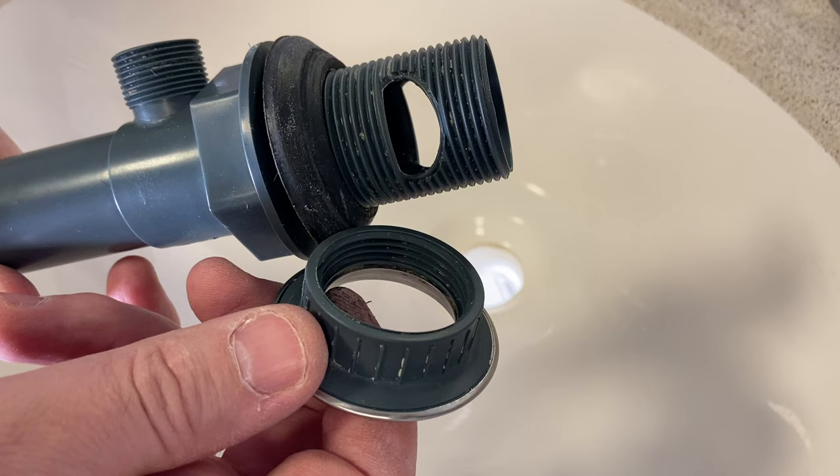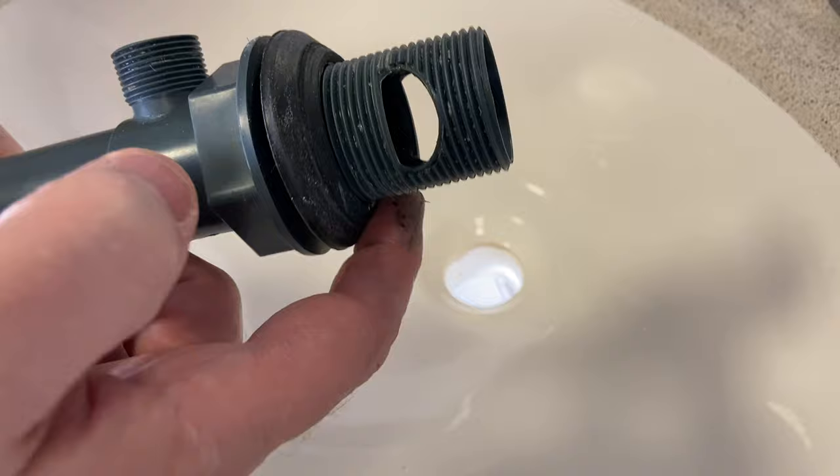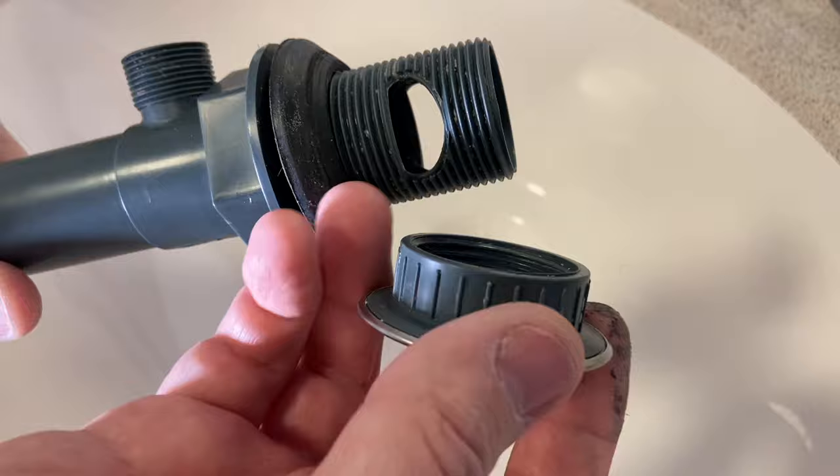So I'm just going to clean all this off. This is actually a Glacier Bay faucet, and a lot of times with these plastic-type faucets — there's a ton of flex in them — I silicone them. I put 100% silicone right around this top nut right here, and then right around this bottom washer right here, so I kind of silicone both sides in. I'm also going to go ahead and put a little Teflon and some pipe dope right here for when I put these two things together on the sink.